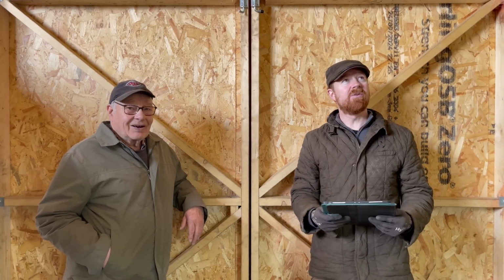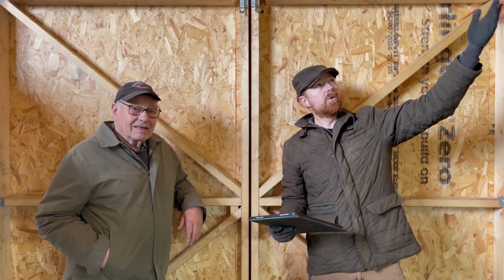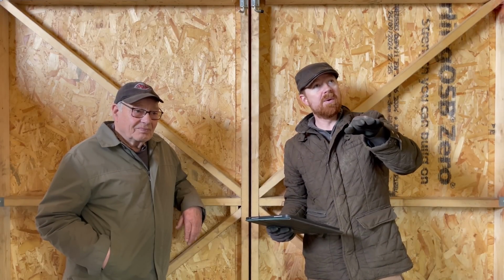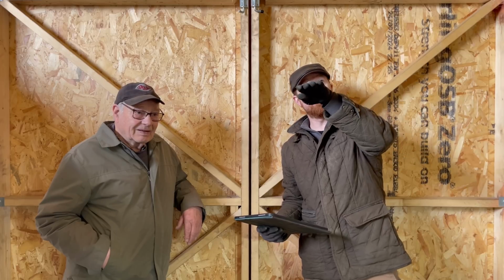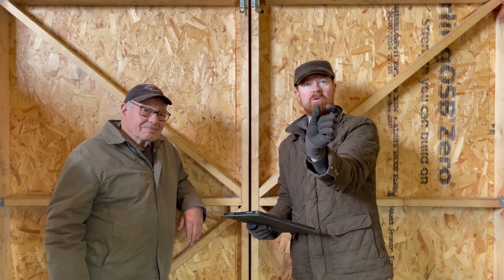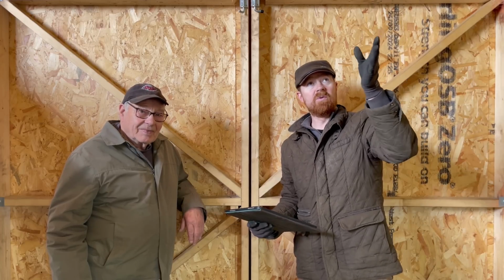What we had to do was, I don't know if you've seen in the video or not, but we did the runs all the way from front to back. The first one we put where we wanted it to overlap on the first joist. And the next one, when you put the board on, was coming over the top of the joist because it was measured for the previous boards. So I had to literally take a sliver off all the boards once I put them on with the ripsaw, all the way from front to back, to then get the next board to overlap on the next joist.